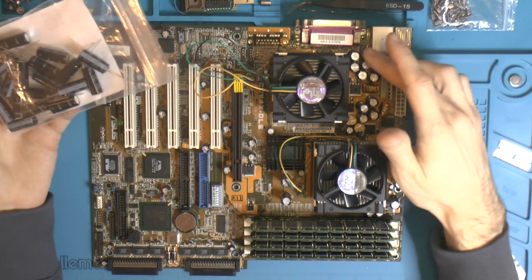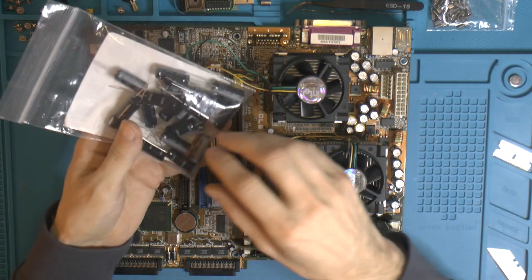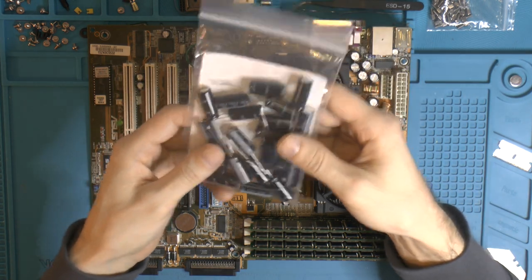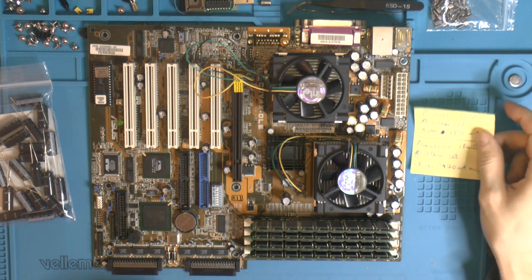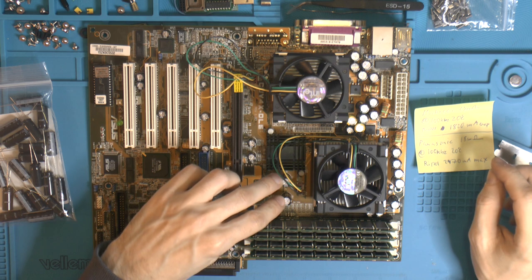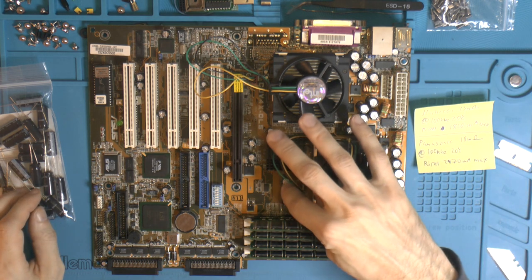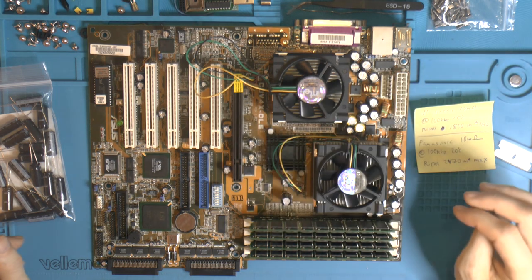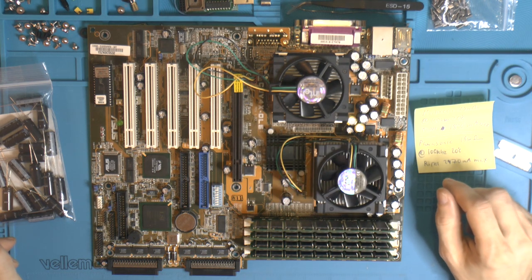For the big ones over here, over here, over here, I got Panasonic instead. It's not that I don't like Nichicons, but these Panasonic are marketed as low ESR. I have specs for both. A cheat sheet note here would tell me that all caps have some resistance. In a perfect world, if you draw a circuit on paper, you might just assume the cap has no resistance, but it does have resistance, which also means losses. That's what people refer to when they talk about ESR or impedance.